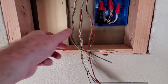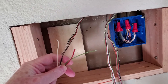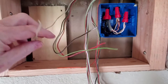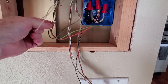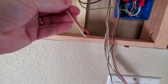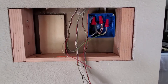Let's take a look at the wiring. From each of the wall stations — the remote stations — there's a 4-wire connection. In this case it's an M&S sound system; some systems might have 6 wires, but it doesn't really matter. You only really need 2, but since we have 4 I made use of them. I joined the red and white together for positive and the green and black together for negative, which allows a little less voltage drop across the length of the line.